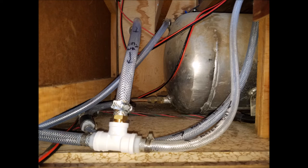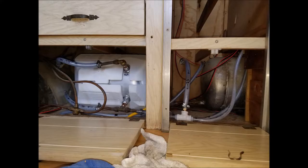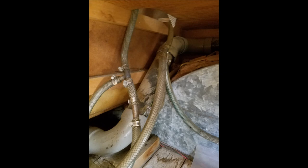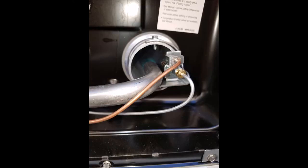This is the backside of the new water heater. You'll see that the pipes are marked, showing the next person who gets to work on it — could be myself — how everything is piped in and working. All new clamps, new pipes, new fittings. Here are some of the old fittings, and what I'm doing is checking for leaks, because I was taking pictures of the pipes as I was running water pressure through. No leaks.